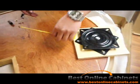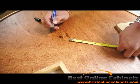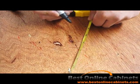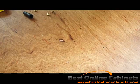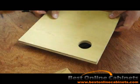You will now begin the assembly of the Lazy Susan turntables. Take one of the turntables and flip it over so the bottom is facing up. You will find a small hole drilled to mark the center of the square. From the center, mark the corners of the square at 3 1/4 inches. Center the metal Lazy Susan on your marks and place a screw in each of the 4 corners that was marked.